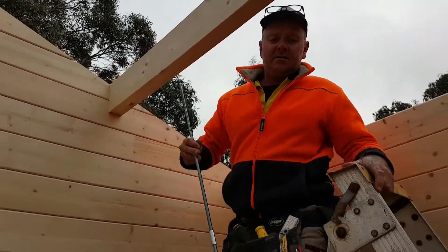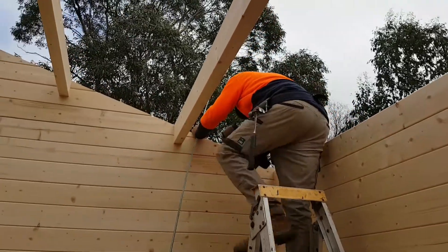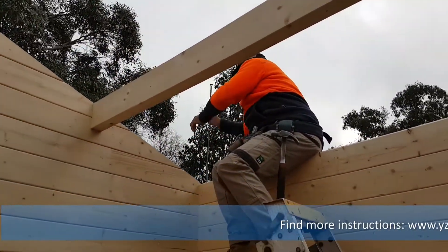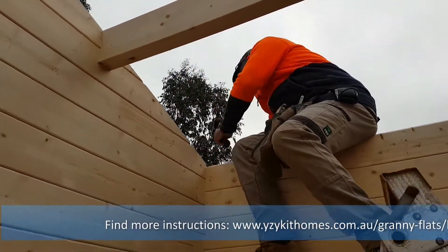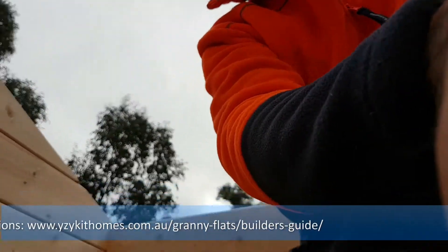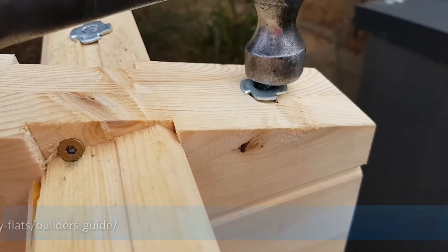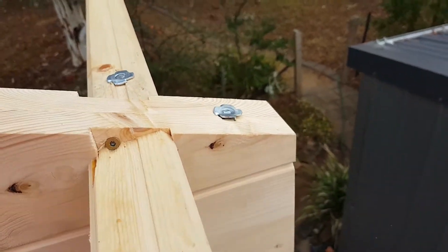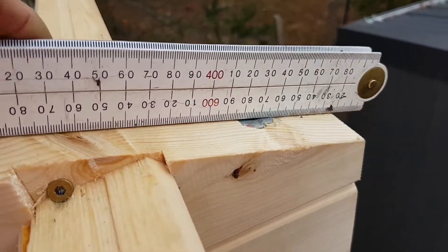And the rod's lost in the wall — we want to drop it down into the hole. I've got a guy underneath and he's going to locate the bottom and put a nut and washer on. Are you ready, guy underneath? What I'm doing now — you can see the other ones already in there — we just get the hammer and bang it down below, and now our lining boards, sealing lining boards, will ride over the top.